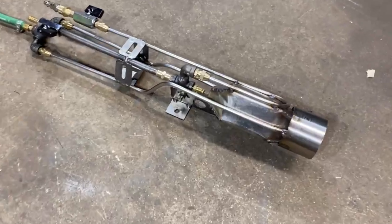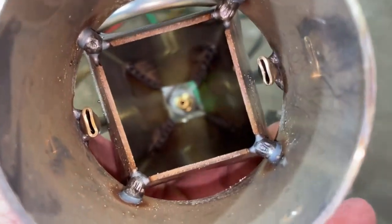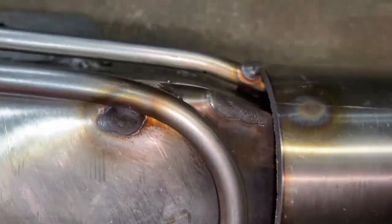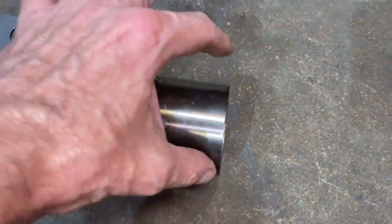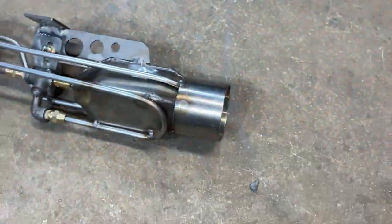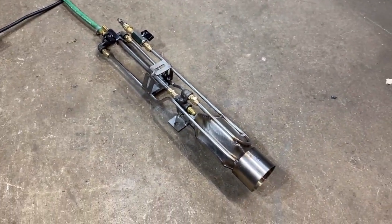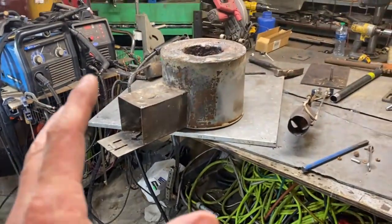There are our oxygen lances and those are at an angle — I don't know if you can see the bend in that or not, but there is a bend to those tubes so that the oxygen meets at a point. It's a fanned spray, so hopefully we've got two fanned sprays going into the fuel stream, and that will hopefully give us some extremely hot flames — hot enough to melt the crucible.